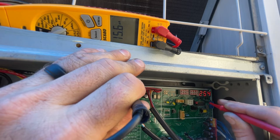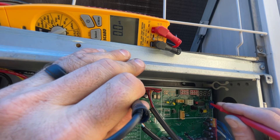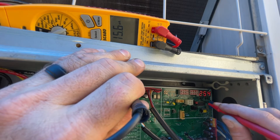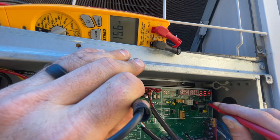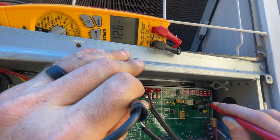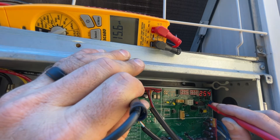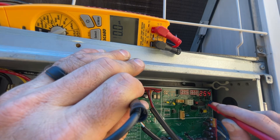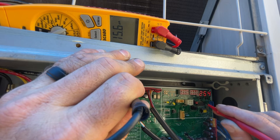I'm pulling its 5-volt signal to ground, telling it to go into vacuum mode. When I release it, you can see it's not staying in vacuum mode, because I'm acting like this switch by pulling this 5-volt reference to ground. I have another video on HVAC sensors that explains how these circuits work. I'm gonna try to get some contact cleaner in this switch, otherwise I may have to solder a jumper on to get it to stay in vacuum mode.